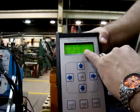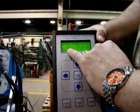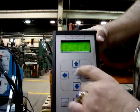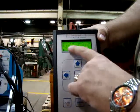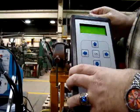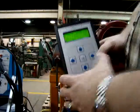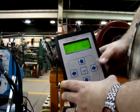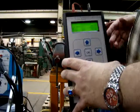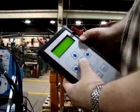What we're looking at here is we have slightly unbalanced resistance. The phase angle is off by more than one degree, meaning that we have some type of short. Measured balanced here and balanced here, so it looks like we have a slight short. What we'll do is change the shaft position and run the test one more time. Shaft position is changed 90 degrees. We'll rerun the test.